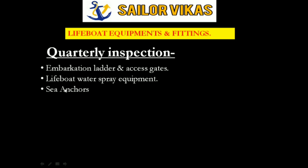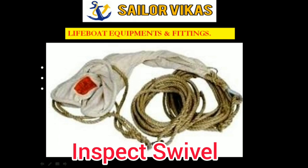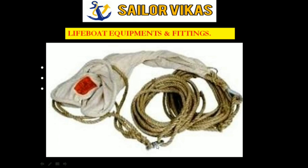So the third thing is the quarterly inspection of sea anchors. Now sea anchor is the only lifeboat equipment which is inspected in quarterly inspection. So sea anchor is one of the important things. You have to make sure that the rope is not rotten or damaged because of the moisture, and there is a swivel. This swivel, when I inspected in one ship, was completely rusted, and it was not at all moving, it was frozen. So make sure that you regularly inspect this and de-rust this and apply proper greasing and make it well lubricated so that it is moving and not frozen.